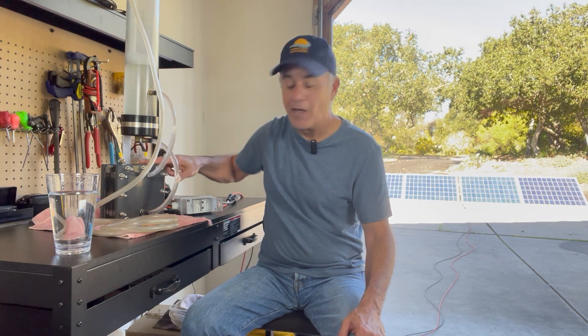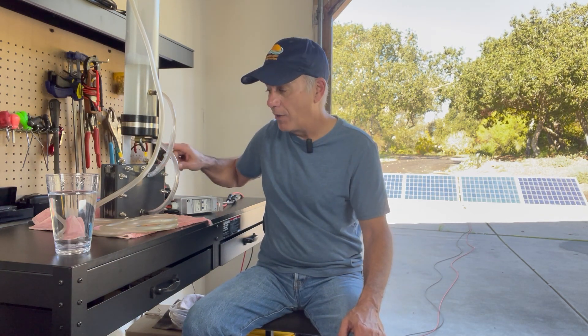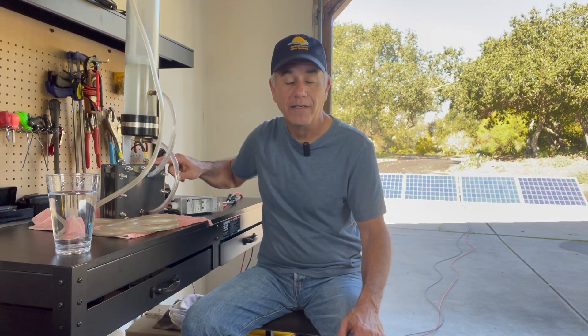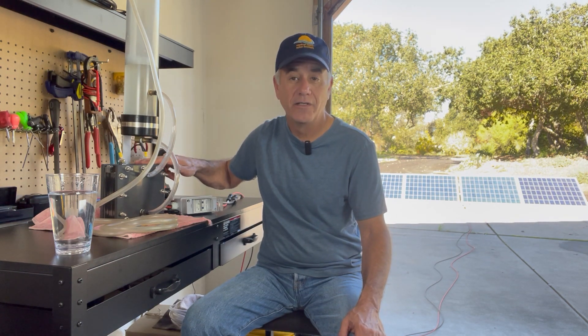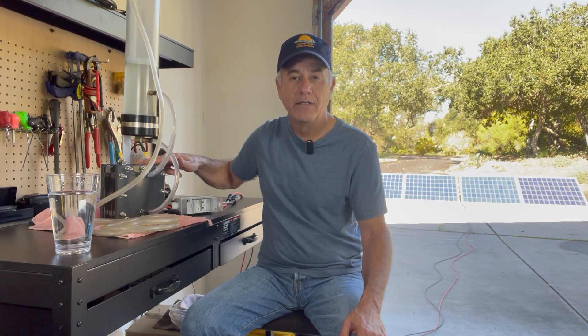At 50 volts and 11 amps — but the cell is cold, so I imagine once it warms up it's going to start drawing more amps, maybe higher voltage. I don't know, since I've never hooked up a dry cell to a solar panel before. This cell has 22 plates: one positive, one negative, and 20 neutral plates in between. As you may know, you want to get the voltage between each plate to around 2 volts. This is going to be a bit overdriven — I measured about 2.4 to 2.5 volts between each plate gap. That means the cell is going to run hot if I leave it on for very long and will probably get into a thermal runaway situation.